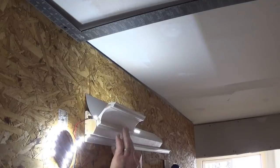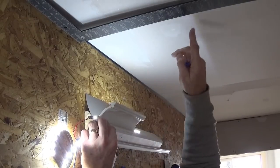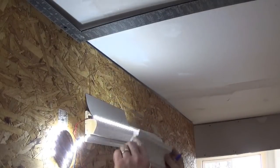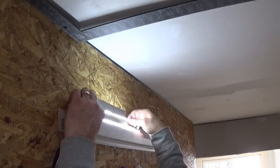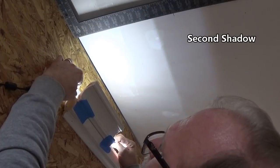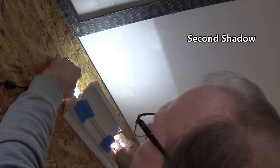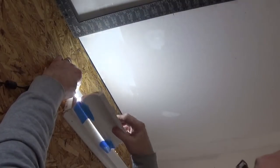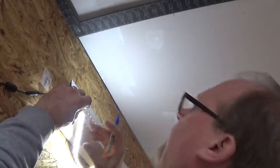I'm not putting colored lights in — this is not a disco, this is an art studio — so you want the proper amount of light. I'm just playing with the cove molding and showing you where the light line is on the ceiling. This is the second strip of lights, separately controlled with its own switch. I can adjust them up and down on this piece of plastic with that radius, so I can decide where I want the shadow. The first shadow should be about 12 to 13 inches out and is hard and defined; the second shadow should be about 24 inches out and is more gradual. By using that curved radius I have the flexibility to position them on the fly.